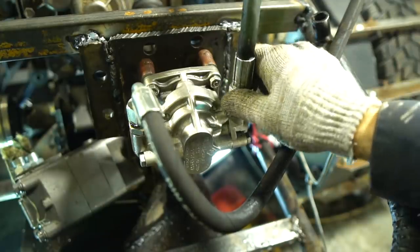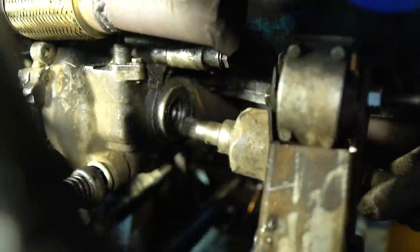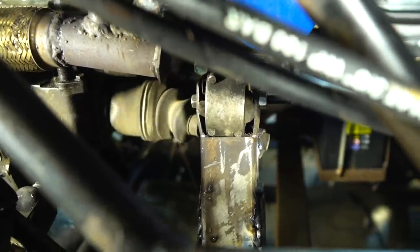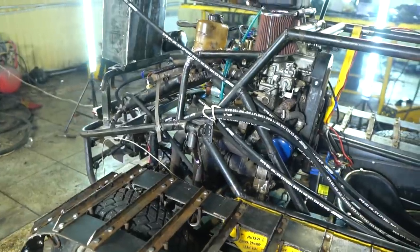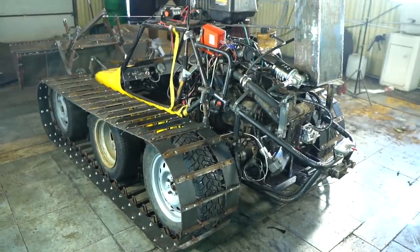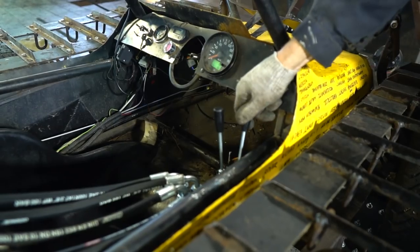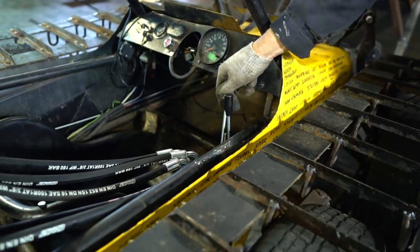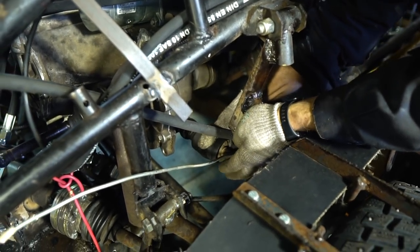There was no beating, which means we can put everything together and check the work out. The engine will easily cope with the gear pump. In order for the oil not to flow out of the gearbox, I closed the hole with the second drive and fixed it through the ring on the bracket. At first speed the gear ratio is 1 to 4 — there are not enough revs for the pump. At second speed it's 1 to 2; the pump works but that's not enough.